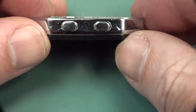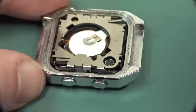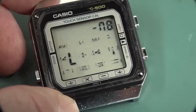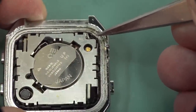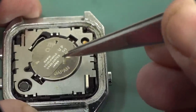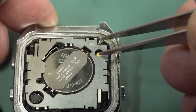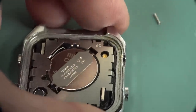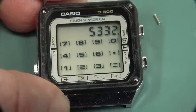It's not easy getting these things back in — the tolerances are ridiculously tight. Fingers crossed it works. I'll try the all-clear button again. A little pro tip: because that AC pad is recessed all the way down in there and you have to short it out to the case ground, you steal the spring from the piezo buzzer. Just steal it from there, whack it in there — but be careful it doesn't spring anywhere — and then you can short it out with a pair of tweezers or just bend it over. That's how you get it going again, because these things usually need — they don't have a power-on reset. Ta-da, we're back. Yes! Winner winner chicken dinner. Absolutely fantastic.